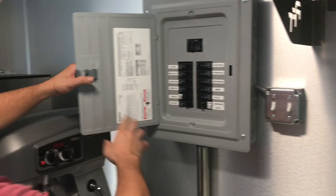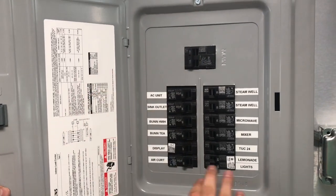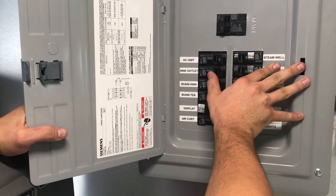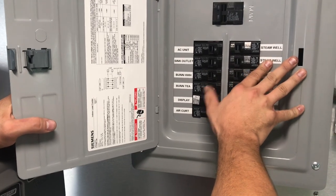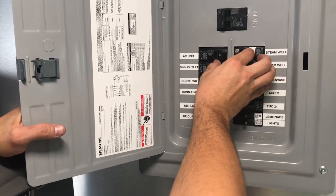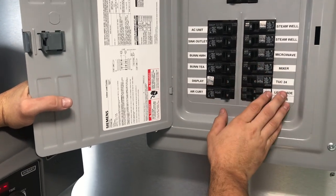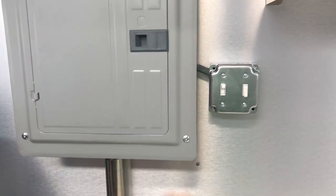We can move over here to our breaker panel. This breaker panel does have a main on/off breaker — go ahead and switch that to on. When turning on all our breakers, we want to go in one row and allow three-second intervals between each breaker. Go ahead and get that AC unit on. What I'm doing here is letting the generator catch up to itself and supply the proper power. This is going to help with the longevity of the generator and make sure you don't shut it off prematurely. Now we've got our lights on — go ahead and click that switch.